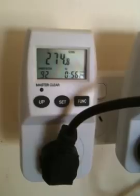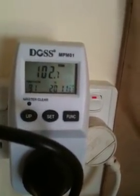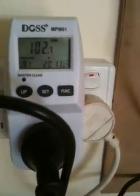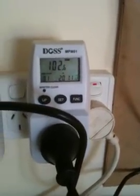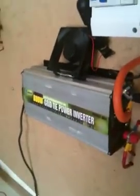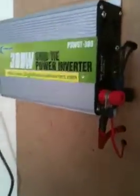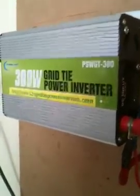The one next to it also has a turbine on it and it's quite windy today, but it's not that windy. That one's making 100 watts but it's got 200 watts of panels, and it's running at 24 volt. That unit there is 24 volt, whereas that one there is only 12 volt. I'd go 12-volt panels and 12-volt inverters — well it's 14 to 28 volt range.